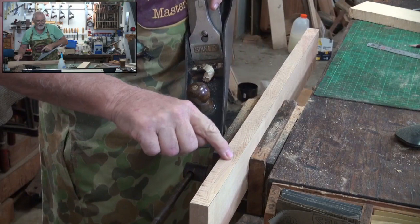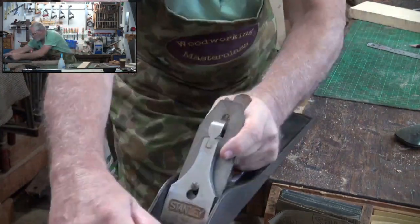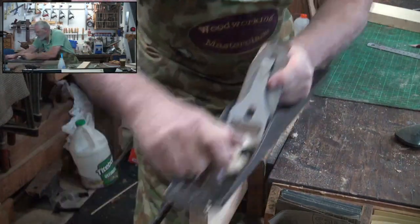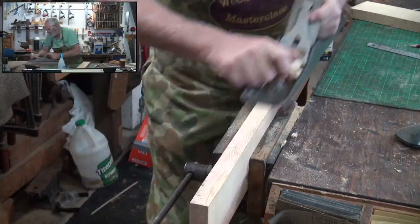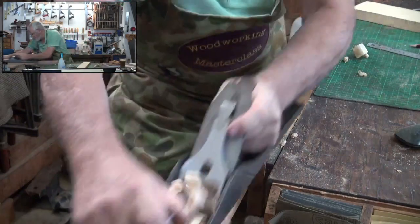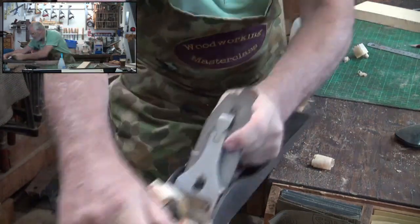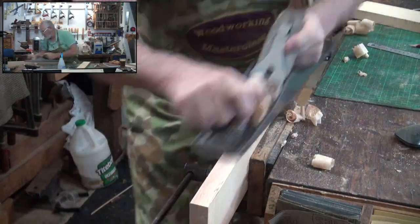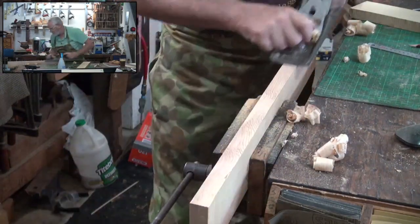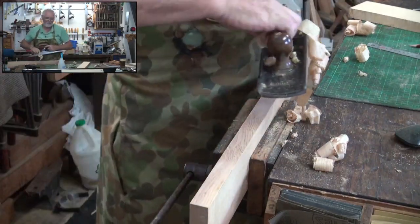You can see this piece here that's shiny — it's starting to grow, that means we're planing that down and starting to grow here, so we're starting to get it nice and flat. You can nearly hear that coming all the way through — got a bit of hit and miss here in the middle. And there we go, nice long shaving.